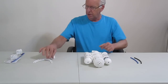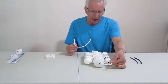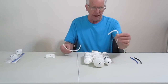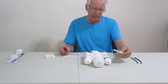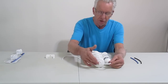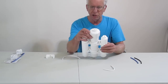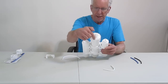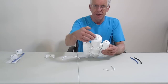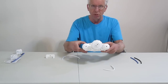At this point you have what we call a J line and a U line — J line up here, U line down here. Now these lines are already pre-formed, and the reason we do that from the factory is there's no undue pressure on the internal O-rings on your quick connect fittings. The RO membrane no longer has screwing quick connect fittings — they're internal, which really makes this a nice system and it's not as prone to leaks.